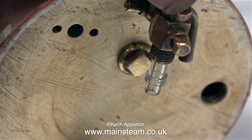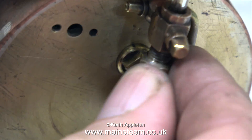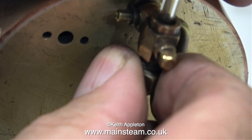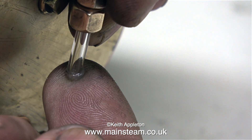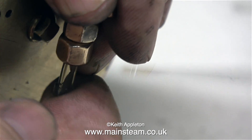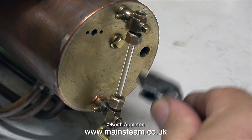Here's the fitting process in detail. Push the glass tubing through the top fitting, and fit one of the pieces of silicone rubber tubing. Then fit the brass nut, and here I'm partially tightening the nut to hold it in place. The next step is to push the glass tubing down a little bit further, followed by fitting the second piece of silicone rubber tubing. Once again, by watching that clip, you realise how important it is to round the edges of the glass.